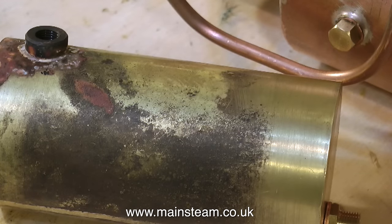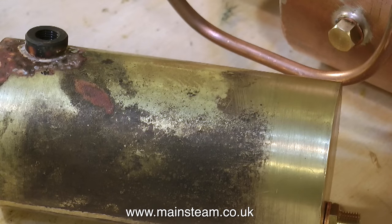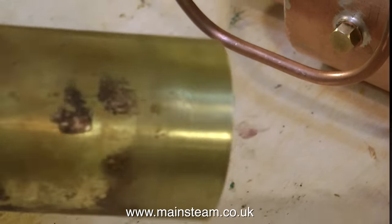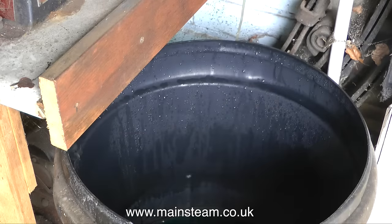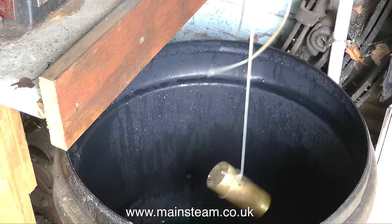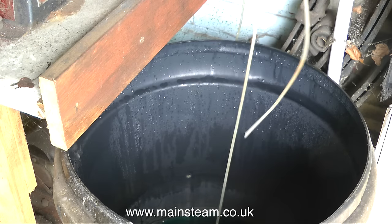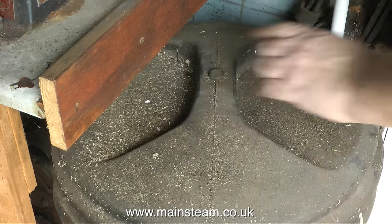So I'm going to fit a pipe union at the lowest point to allow the condensate to be drained into a suitable container for safe disposal. In this clip you can clearly see the condensate fitting in place, but I'm going to remove this because the whole thing is going to go into my acid pickle bath. Here once again is my acid pickle bath, and here is the part going into it. Just before the close of this episode I would like to say: I would never make a pressure vessel using a brass barrel — this is not a pressure vessel, it's just a through condenser. Thanks for watching and I hope you found it useful.